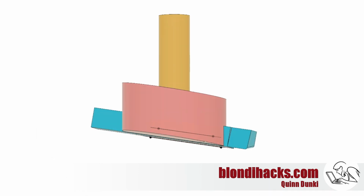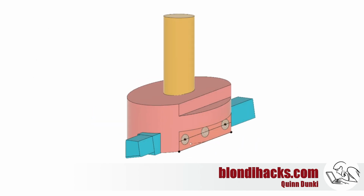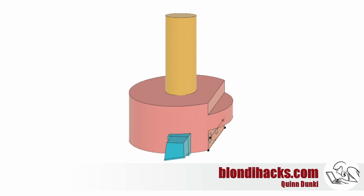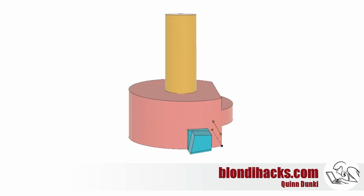With something that spins, it doesn't just matter that the weight is the same on either side of the balance point. It also matters where that weight is distributed relative to the axis of rotation. So what we've done here is basically what used to be called a bubble level for car wheels, where we've just balanced it and added weights on either side until it sits level.